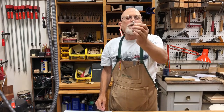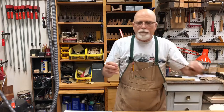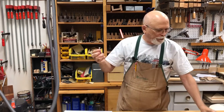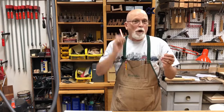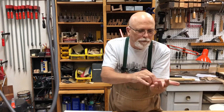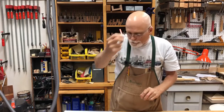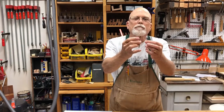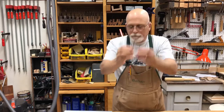That slot — it's easy for the screwdriver to slip out. You have to find the screwdriver that fits that slot appropriately. This big screwdriver actually fits. This is a number 14 screw. The screws and screwdrivers have numbering systems — the smaller the number, the smaller the screw. See that little screw? That little bitty screw is a number one. And this would be a number 10, and a number 8. Eights and tens are probably the more common sizes.